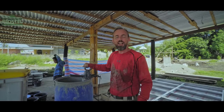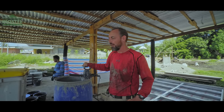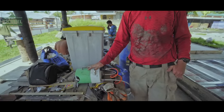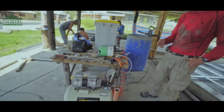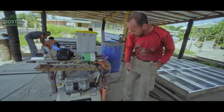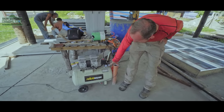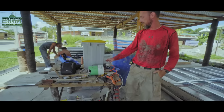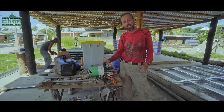A quick lesson in how I mix AirCrete. I've got my foam set up over here, my air foam generator, and my compressor. My initial pre-checks are to ensure that my output on my compressor is at 90 psi. On this particular setup I end up at 40 psi on here to generate the correct foam ratio.